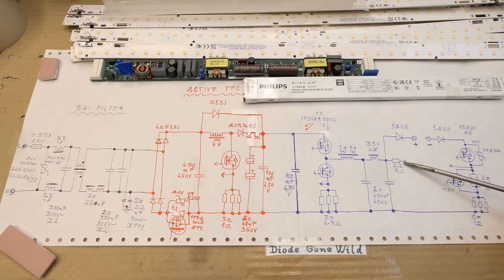Another capacitor, then some resistor for voltage sensing - to sense the voltage drop of the LEDs - going into some circuitry, and then a protection diode going into the positive of the LEDs. The negative goes via another protection diode and through this transistor, which I guess is some sort of protection that can disconnect the LEDs, protected by a metal oxide varistor. Then this set of current sensing resistors in two groups, one of which can apparently be bypassed using a tiny transistor. This is probably how the current regulation for dimming works - bypassing those resistors reduces the sensing resistance and increases the current.